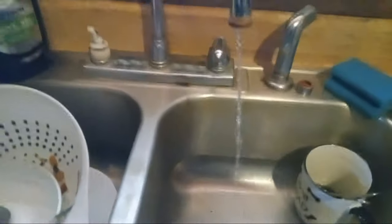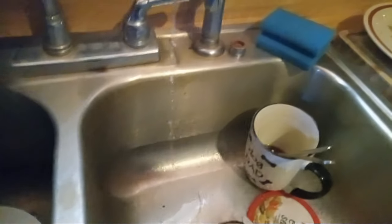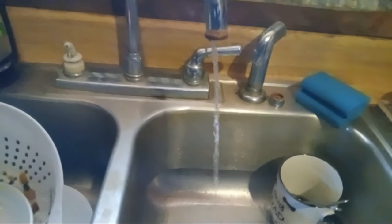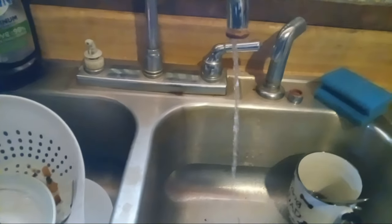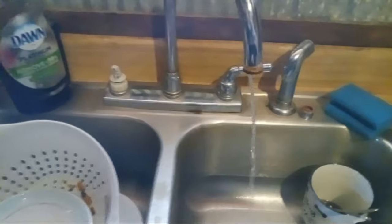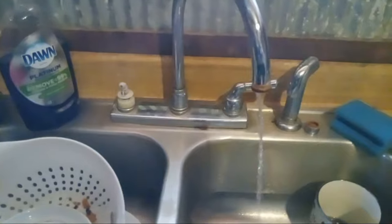I need to wrap it better. We do have water but it's frozen. Run the hot water and that'll thaw that out. Now I need to go out and see if the tank built up again, because it doesn't have any way to release the pressure — so it's building back up in the tank. That's why you need a relief valve, which I will go get tomorrow.